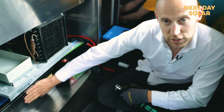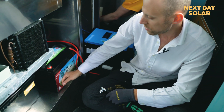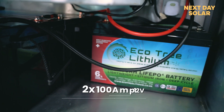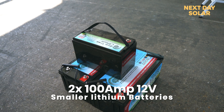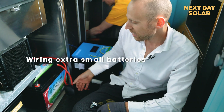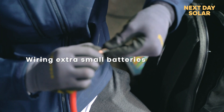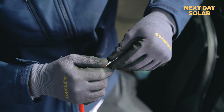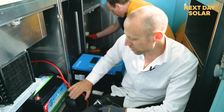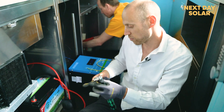The big batteries are now wired in and running. Sadly, Ecotree Lithium are waiting for a delivery on the smaller batteries. This smaller battery is 100 amp hour, 12 volt — about 1,200 watt hours of energy. What I'm doing is getting all the cables ready on site, so that when the battery arrives we can just wire it up. I'm putting them in a safe protective box with all connections ready to wire into the bus bar, sealed away. When the batteries arrive, we simply open the boxes, connect them, and off we go.